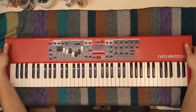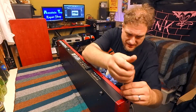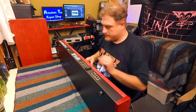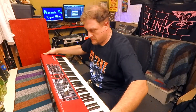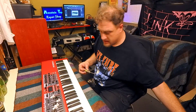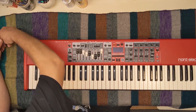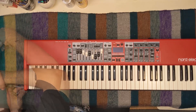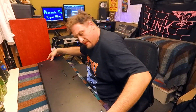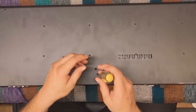Now we're going to figure out which screws are necessary to remove this front panel. There appear to be some evenly spaced screws on the back - we'll remove those first. Next I'll remove the screws on the wooden side panels. It seems to be attached to the back center, so let's flip it over and take a look. There's one screw that attaches to a standoff that supports the middle of the control panel.